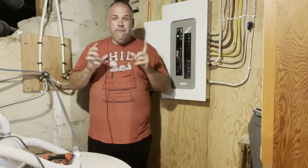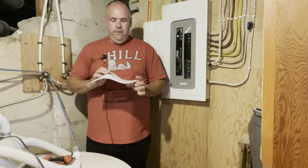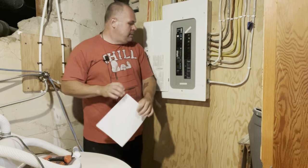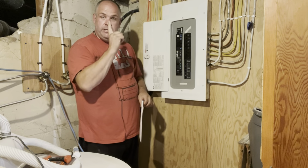So there's a few things. The first thing I ended up doing, because I couldn't find one on the internet, and I'll put the PDF link in the description, is I made a quick little template here. So I have 30 circuits. Some are 220, so they're a double pole, so two numbers are going to take up one circuit.